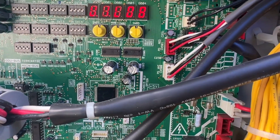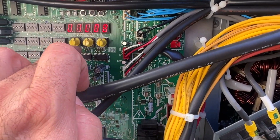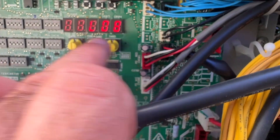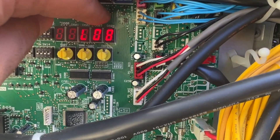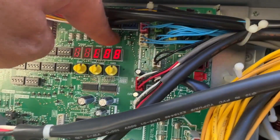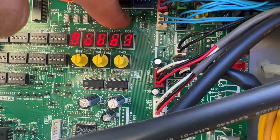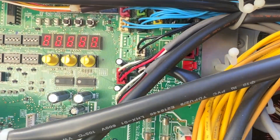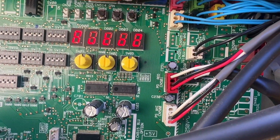Right now we're going to address the 4 units in there. We're gonna leave this on the 111 dial. We got the U1-L08 flashing. What we're gonna do is hold this SW15, which is right above here. Hold that for a few seconds and it's gonna go to auto.